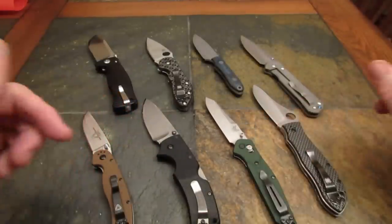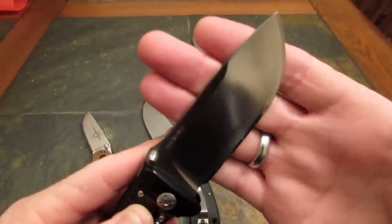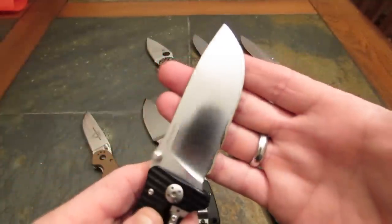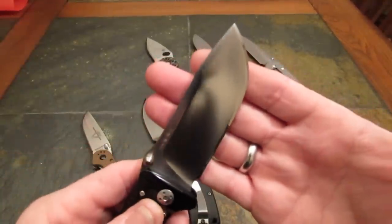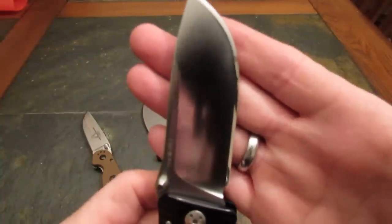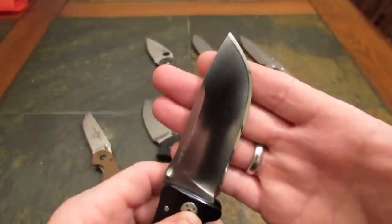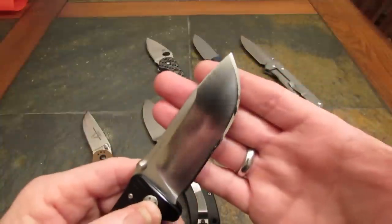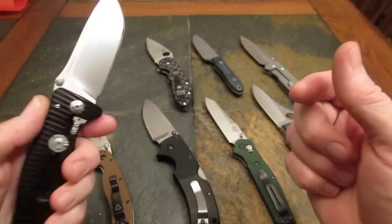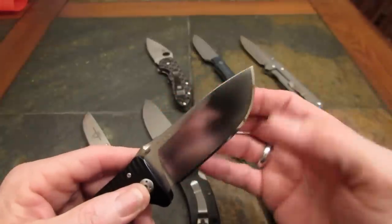The worst factory edge for initial sharpness and consistency was by far the Lionsteel SR1A. These are made out of pretty hard D2 steel and they come with an atrociously round convex edge that is neither sharp nor consistent. It's too bad, because the main grind of the knife lends itself to a super consistent edge. After three hours of work you're looking at a 15-degree secondary bevel — notice how consistent it is root to tip. That's what the main grind is capable of yielding; they just destroy these knives when they sharpen them. They literally make them unusable before they put them in a box and ship them. Hiding inside that horribly ground edge is one of the best cutting production knives in the world.